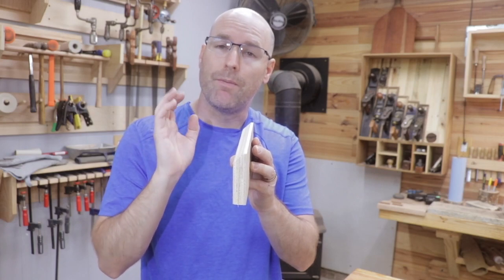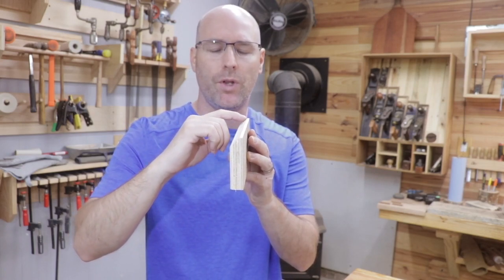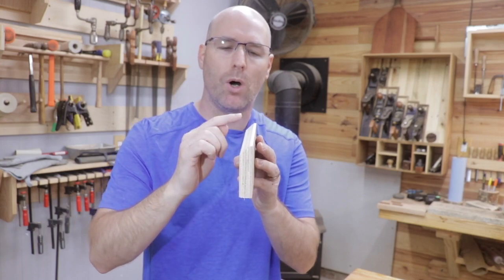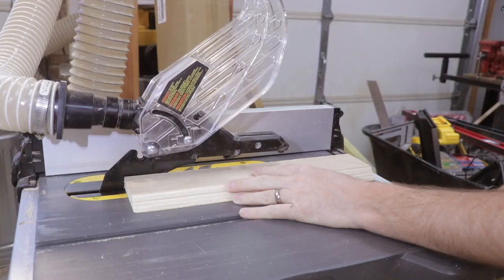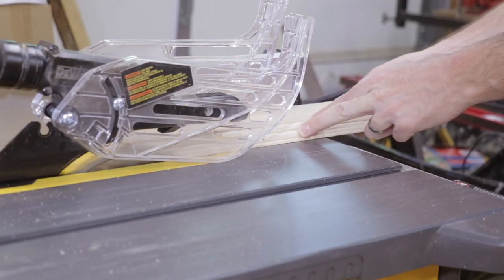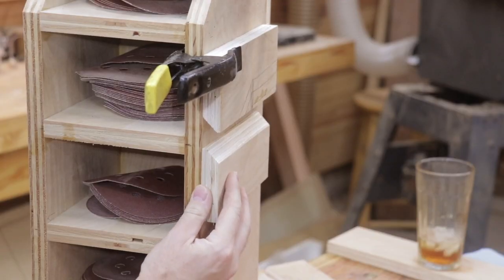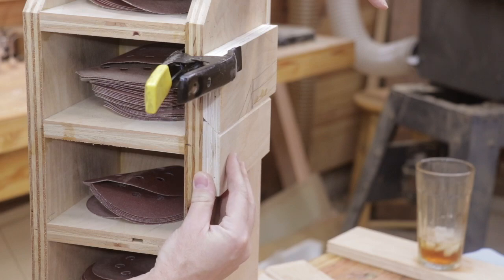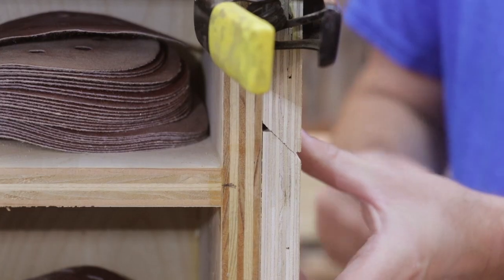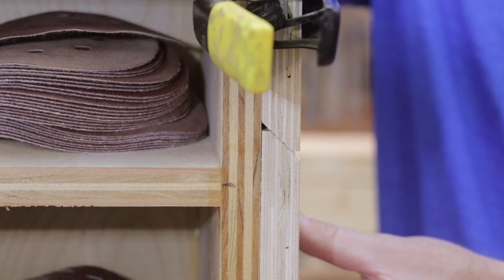So that brings me to the suggestion that many viewers have made, and that is to bevel the tip of that 45 degree angle on both the wall cleat and the tool cleat. Creating that slight bevel would be most easily achieved using the table saw, but you could also use your hand planes as well. That will prevent your cabinet from not sitting down on the cleat well because of dust buildup, and it will also eliminate or at least minimize the risk that you glue your cabinet to the wall.